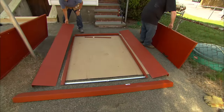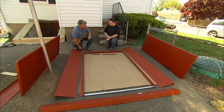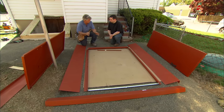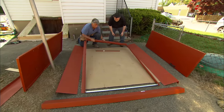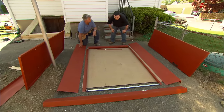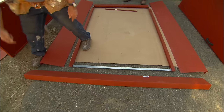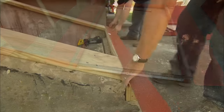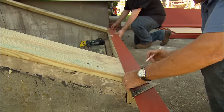All right, Joe, here's your new bulkhead door. It's pre-primed steel, 12 gauge, nice and heavy, and comes in a couple of different pieces to allow for different sized foundations. This piece right here is the frame for your doors. These side pieces and the piece on the bottom are called foundation plates. We're going to start with the bottom one and put it on your frame. All of these pieces come long so we need to mark them to length and cut them with a grinder.